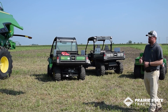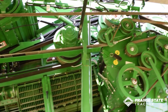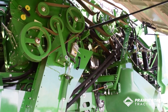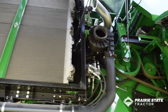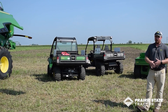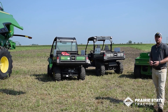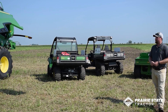The belt design — some of you probably noticed how many belts we have; it seems like a lot. It's actually the same number of belts as an S790, and we have two fewer belt changes. The belts are the most efficient way to transmit power. Going away from hydraulic motors and chains, we're about 90% to 95% efficient with the belt drive from engine to each feature on the combine. We also increased the size of our pulleys on the X9 and have longer belts, so more curvature on the pulley and longer belts means better belt wear and helps with that efficiency.